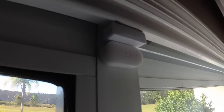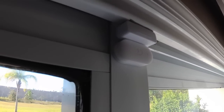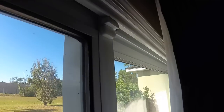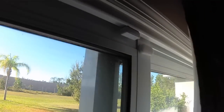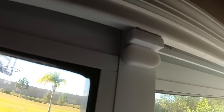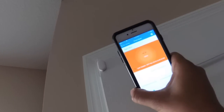Now a couple of things you need to know. If you add the sensor and it doesn't register whether it's open or closed, repeat the process to add the sensor again — make sure to delete the sensor before trying to re-add it. I had to do the entire process twice before it started to register open and closed. If you get it up and running and all of a sudden the device is unavailable, again delete it and add it again. Mine became unavailable only one hour after install, so I had to do the process again. But don't worry — I've had mine installed for over three weeks now and it has been working great. I haven't had to delete and re-add it since.